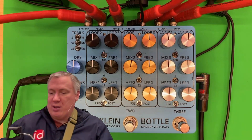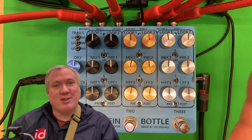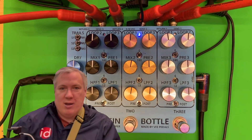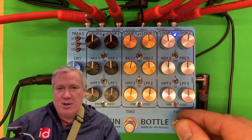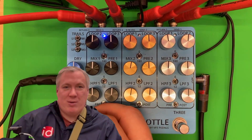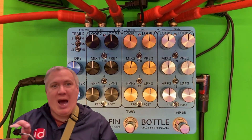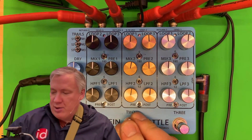What I want to tell you is about my progress. Functionally, all those controls do what they're supposed to do. But there are a number of quirks I'm still working out. First, when I turn this on — it's connected to a delay — you hear that pop. That's a bit of a quirk from the build. If I do the other loops, there isn't that same level of switching pop. There is a little bit, so I'm going to do something to take that out. I think this is part of the issue with the build — there's a short because I was doing all these things by hand and having to hack in some fixes that I won't have to hack in on the final version. Anyway, that's one quirk, but I'll get that worked out.